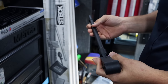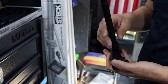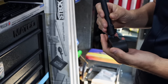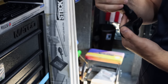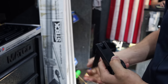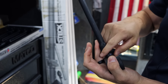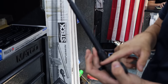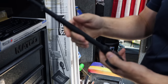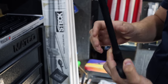The only thing I am going to tell my customers: let's never do it like that right there. Anytime you take a tool that has a pivot point like this, even with a hammer and you max it out, it's not so much the pin — because the pin's taking abuse any way you move it — but you're going to start eating your socket and the shaft up here, and it's going to get real sharp real quick. If you like your tools to look nice and fancy, it's definitely not going to look like that when you max them out.